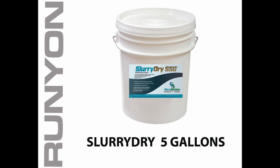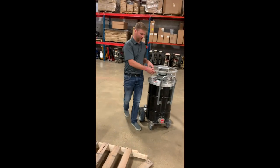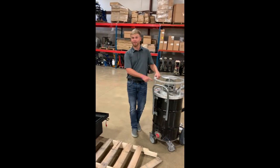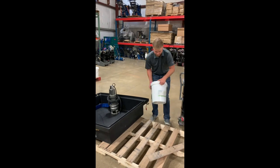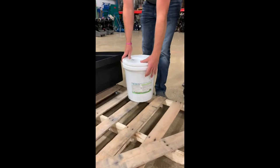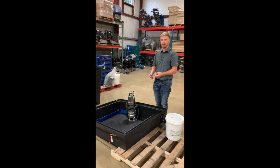Step one, you're going to take your vacuum off your floor — that you just picked up all your slurry in. The lid pops right off. You're going to dump it right into this bin. After it's in this bin, you're going to use this product called Slurry Set. It stands for slurry separator, and what it does is it separates the water from the slurry, so it makes those slurry particles bigger.